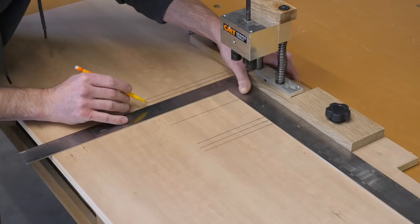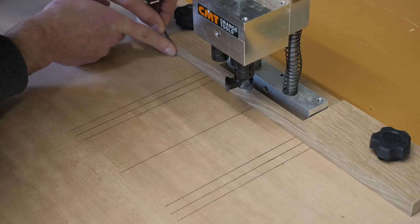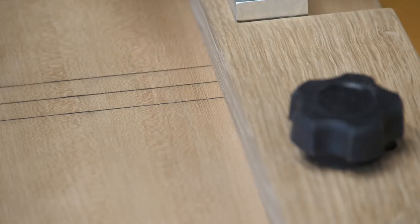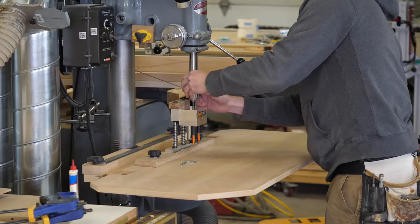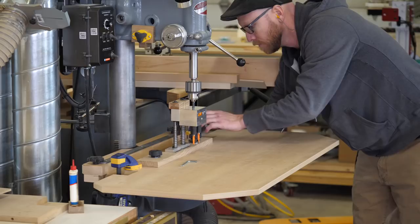I reinstall the drilling aggregate and use the point of the bit to mark a center line on the base. From there, I mark lines at three, three and a half, and four inches from center — these are my standard distances for drilling cabinet doors. I also add a few scribe lines in one-millimeter increments, which will be used to set the fence so it bores the hole at the correct distance from the edge of the cabinet door. It only takes a minute or two and my drill press goes from traditional drill press to cabinet door boring machine.